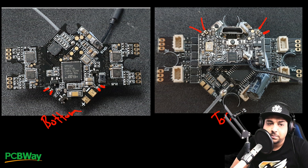The craziest part comes down to the ESCs. I'm guessing this is a BB2 chip — it looks like a BB2 chip here, so it is obviously BLHeli-S. But what we don't find on this is there is no MOSFET driver, no FET driver like every other ESC we've seen. All we have are three FETs, but they're dual FETs — basically two FETs in each package — because for each motor wire, you need two MOSFETs. These are so freaking tiny, it's insane.